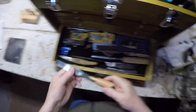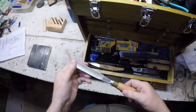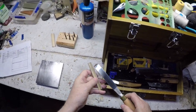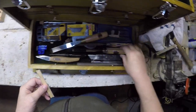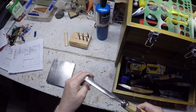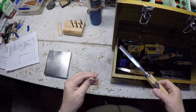Gouges. I got two from Tim Britton — the number four and number six. He uses the number six for tone chambers and gouging out the tail, but I don't do that anymore so I don't use the six. What I'll do is take a number three, set it up on the block, and cut down to the point where I'm hitting new pith all over — relatively flat, but it cuts like butter. Then I go with the number four down the center and sides to start forming the final thickness, probably down to 60 thousandths of an inch, before I start sanding for the final amount.